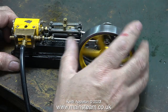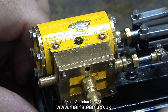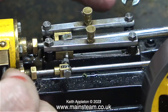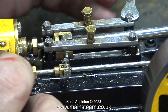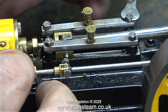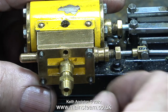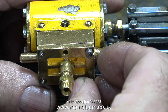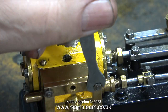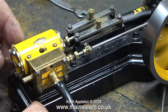I think it's time to have a look inside the steam chest. I disconnect the air line and then take off the steam chest cover so I can have a look at the valve. The port face isn't scored and the slide valve is timed perfectly. I thought it would be a good idea to tighten up the crosshead slide bars, but the slide bar gap spacers are too short — when I tightened the bolts holding the guide bars in place, the guide bars acted as a clamp and it was impossible to turn the engine over. At least the slide valve looks okay, so I'll re-tighten the steam chest cover and give it another run.